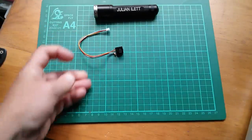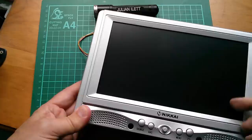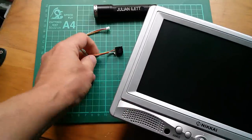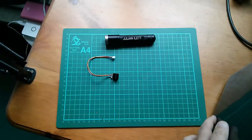So what am I going to do? First I'll connect it to this LCD TV — it's quite an old one, probably quite low resolution, maybe 480 or 240 lines vertical — we won't get the full resolution but we will see the wideness of the wide angle lens and the colour. Then I'll connect it to this wonderful old black and green screen computer monitor, a cathode ray tube. Since it has no colour circuits, we should see colour artefacts on top of the black and white signal — hopefully the 4.43 megahertz colour signal showing as a row of dots.